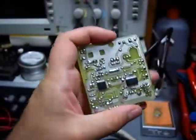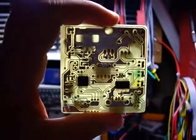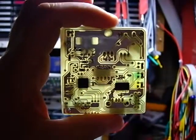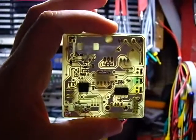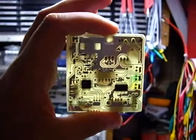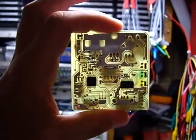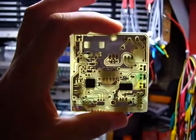So we can hold it against light — you can see the whole circuit very clearly, and if you turn up this video to high resolution mode you can select that on the top right. This is also a way of ensuring quality. Especially on those small chips here, if you hold it against the light you can see any short circuits or any irregularities on the board.